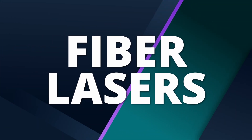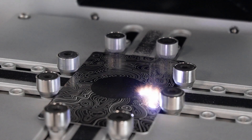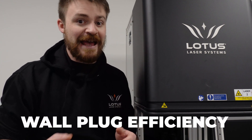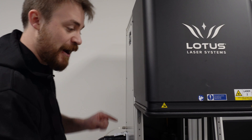Fiber lasers are ideal for marking and engraving metals. They are extremely accurate, so you might see these put to work marking something like a QR code even onto a metal plate. They are very efficient at converting light into energy — about 50% more so than CO2 lasers — and so they have a low power consumption despite their incredible output. The efficiency we're counting here is what you would call wall plug efficiency: basically, how efficiently it's getting power in and putting it out.